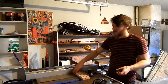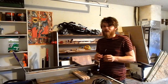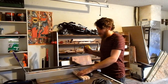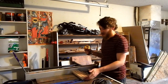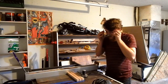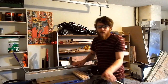Another thing I'm going to do to spiffy up the game board a bit is do a chamfer on the bottom using my table saw. I'm using my fence as a stop. Normally you never want to use a miter gauge in combination with your fence, but I'm not cutting through the workpiece so it won't be trapped between the blade and the fence. In this instance it's fine, but if I was making a through cut, you would not want to do that.